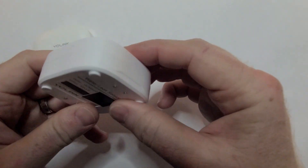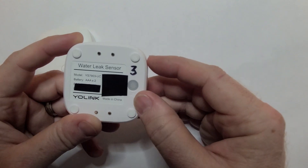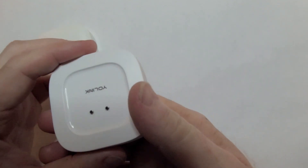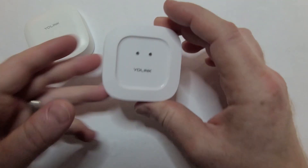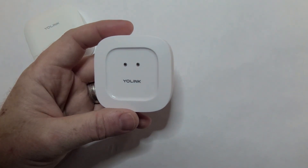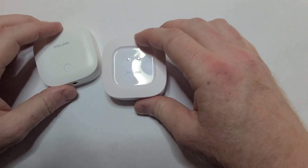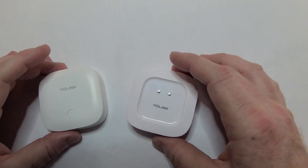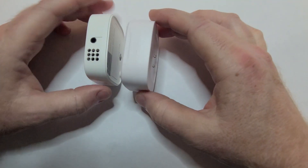This is their other variety, which is a little more limiting. I like them — they're great — but you can see those metal buttons right here are the sensors, so if water comes into contact with those it's going to alert your phone just the same as the other one does, or if it drips onto the sensor it'll touch those contacts. That's just a wet paper towel, and you can see this one does not have an alarm speaker on it — it simply sends the alert to your phone. The drawback to this one is it actually has to be touching the puddle of water, so you have to know basically where the water is going to collect.